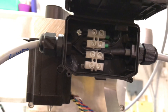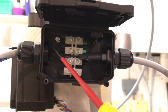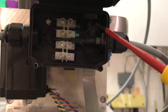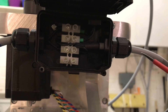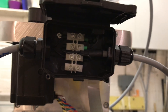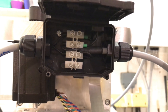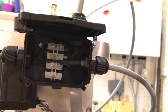That was a bit tricky to see, so just to explain: coming in you've got 24 volts going up and through here, up out to the switch up there and back into this one, round into this one, out to the next switch, back round here into here, and then off. So it's something similar to the diagram shown earlier. That internal block is all done and now I've just got to connect the other ends to the switches.